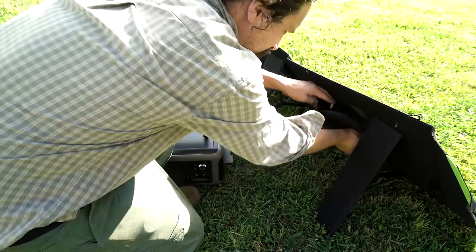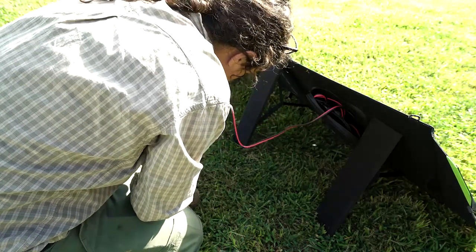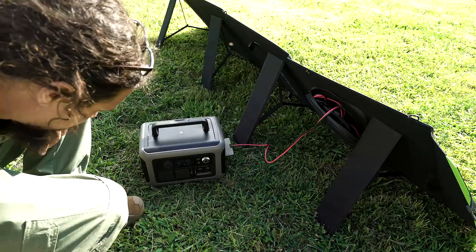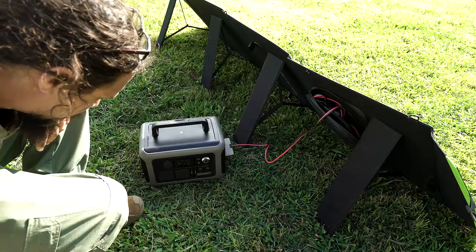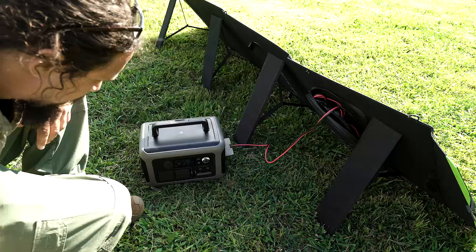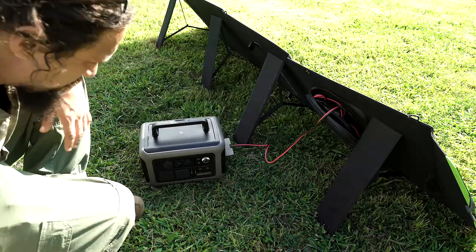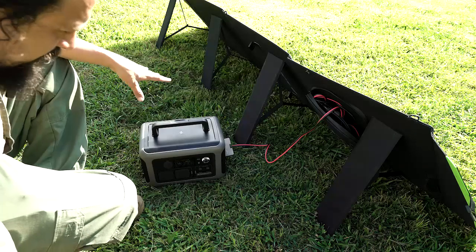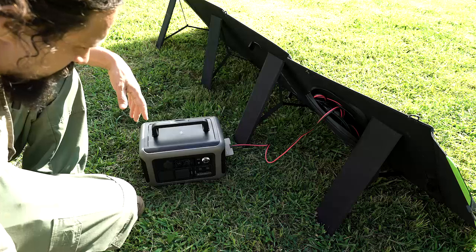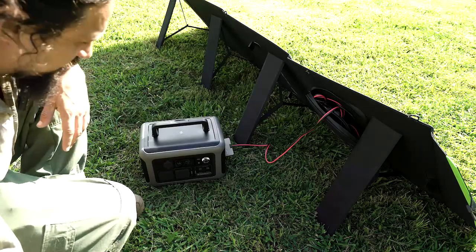It's very easy to connect — you just pull out your cord. I have the XT60 connector on, plug it in and you're charging. Let's see what wattage I get right now. It's pretty late in the day, almost sunset, but I'm still getting 130 watts and the sun is a little bit behind clouds. I've seen up to 165 watts on it, which is great — definitely what I would hope for from a panel this size.